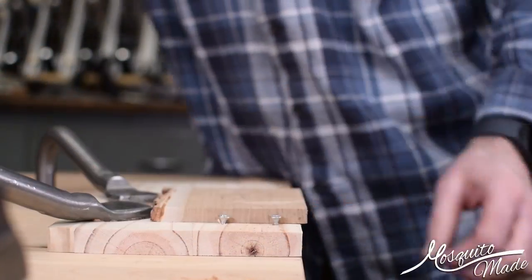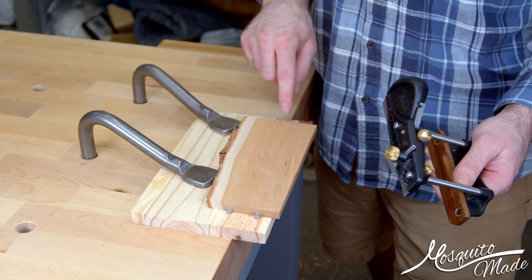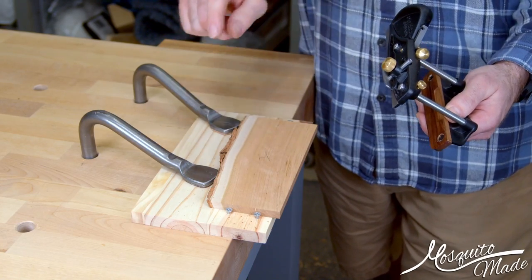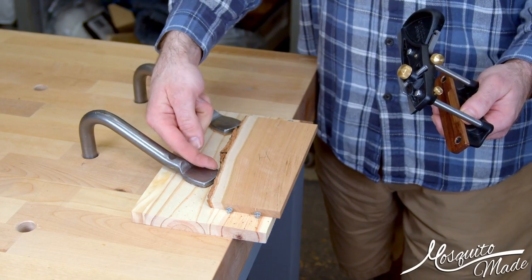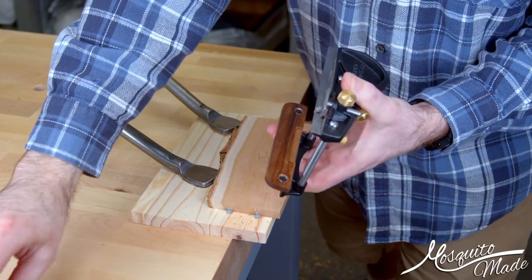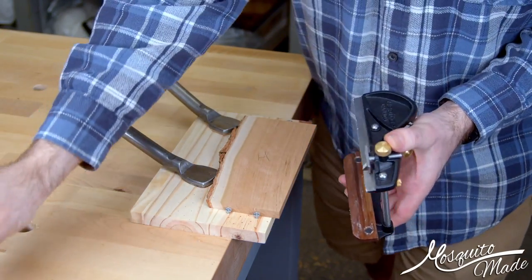Because this is so close to the edge, I can't use the holdfasts on top because they'd be in the way, and then I can't put the holdfasts on the opposite side because I need a reference off of that. So I just have a scrap piece of wood with two screws on the end and one screw on the back. The screw on the back is angled in to hold it together, so it basically acts as a little bit of a tail vise. The two holdfasts hold the whole thing onto the bench and also act as a stop. I'm also just adding a little bit of wax, because that's my habit.